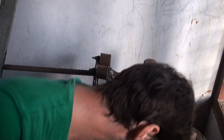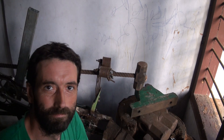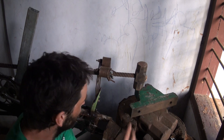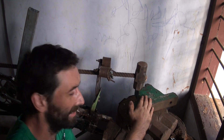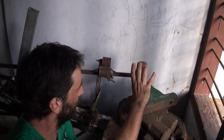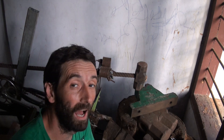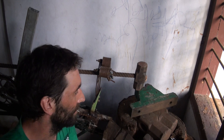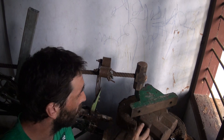I'm almost scared of the thing — it's powerful actually for such a small build, it's got oomph. It's hitting about 2 whacks a second. There's a 5-pound hammer plus the arm itself, which probably weighs another 5 pounds. So 10 pounds of force at 2 whacks per second is giving loads of force — we'd be able to move hot steel no problem whatsoever.